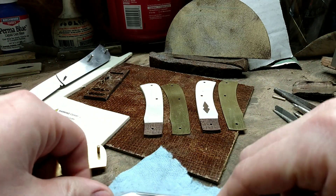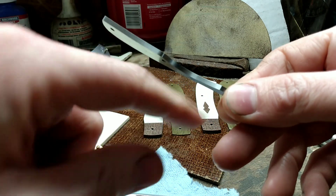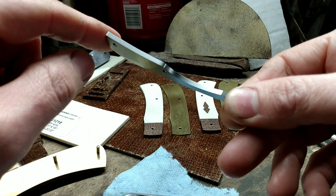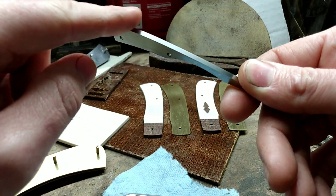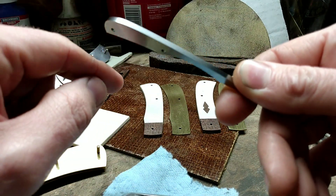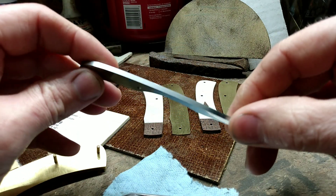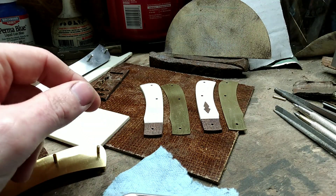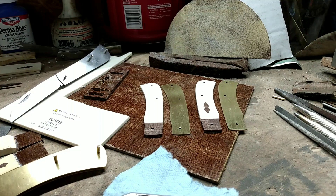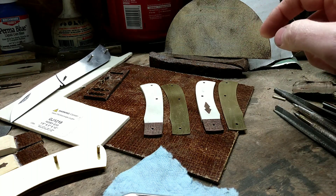On the back spring I've got a 400 grit belt finish on the inside, and I've got a hand finish — 400 grit but hand done — on the spine. I had the whole knife assembled when I was doing that, so the spine of the handle material as well as the liner is hand finished to 400 grit and is all flush now.